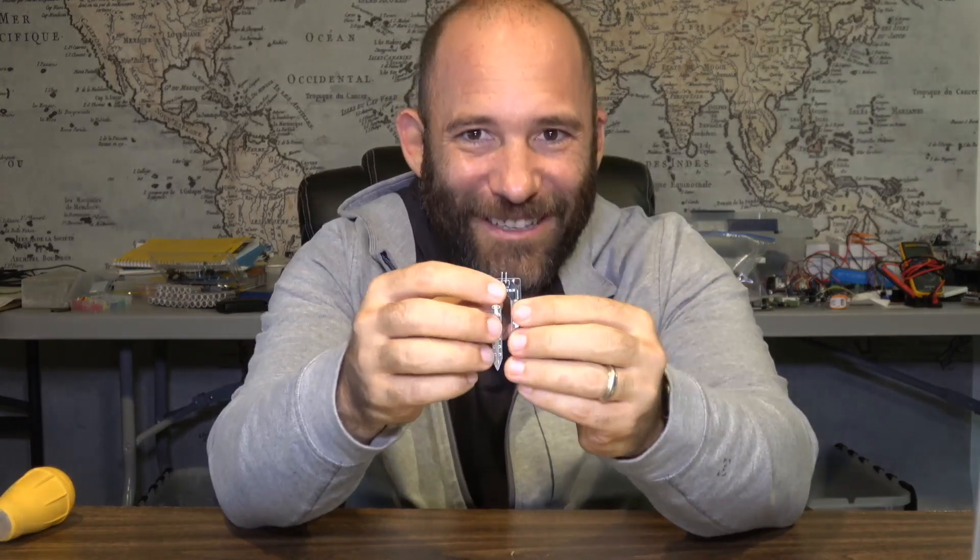One warning: we used the turkey baster today, and this is one of the few times you want water anywhere near your Arduino project. Water does conduct electricity, so be careful. When experimenting, I once shoved the sensor too far into the water, and water got up into the wire connectors. That caused a lot of weird readings because the water was shorting the connections — I was getting false readings even when the sensor wasn't actually connected to anything. Keep the top of the sensor dry.